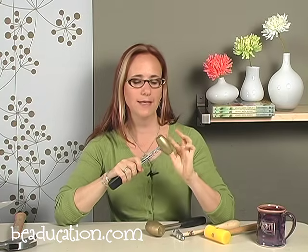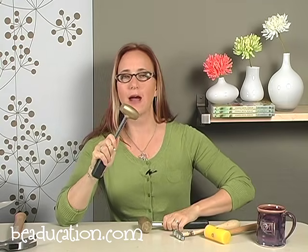Or what I use now pretty much exclusively is a brass head mallet. And what's nice about this guy is the brass, it's a pound as well. It also comes in 2 pound, we'll get to that. But the brass is a very dense metal. So when you stamp, it sits and it hits it like a dead blow hammer. You don't get any bounce back, which can kind of cause a little double impression with your stamp.